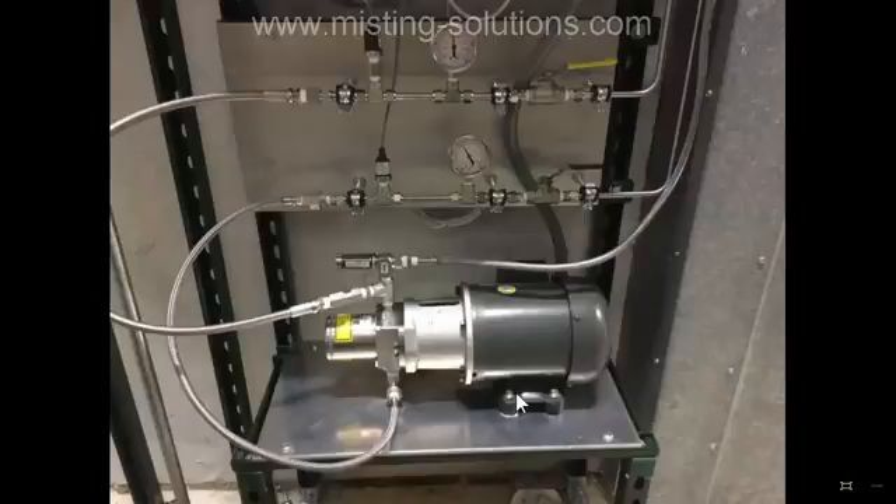The most important aspect of this is to get all the air out of the pump housing. There is a bleed port on top — it's a small screw right there on the top of the pump — and that will bleed air out of the pumping system. The incoming water supply comes down through this line into the bottom of the pump, and the water comes up through the pump housing and casing and starts to come out this bleed hole right there.